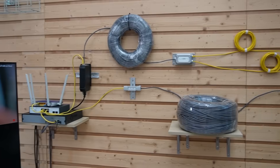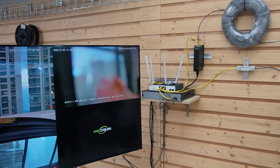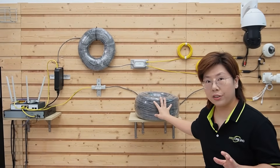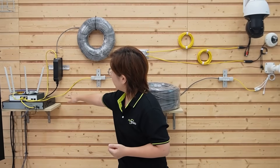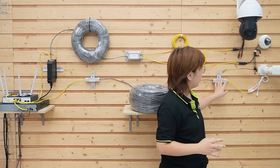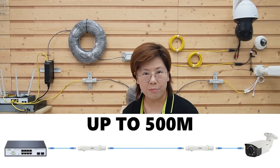Solid video function at 300 meters, powered by PoE, no extra AC in the field. Our door station is at 350 meters, and today we used a 300-meter continuous cable in between. But remember we mentioned 500 meters — we can add 100 meters from the switch to the first extender, then another 100 meters from the second extender to the bullet camera. So total, we can actually get up to 500 meters.